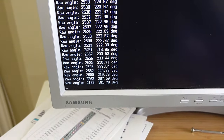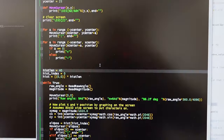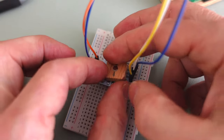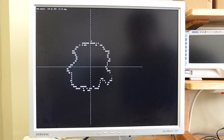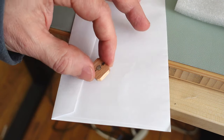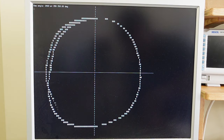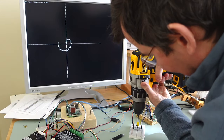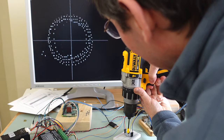So as I slowly rotate this magnet it'll just keep increasing the angle. Now this encoder doesn't just give me the angle but also the magnitude, so I thought why not just plot that on a Cartesian plane, sort of as a vector. So I wrote a little bit of code to do that — if I place the magnet on the chip and rotate it I should get a circle on the screen. But what I get is hardly a circle at all. So I mounted this magnet sideways using some Lego and tried that on the chip. It's quite responsive — I can spin that magnet really fast. But I have to stay very close to center otherwise that circle gets really wobbly.